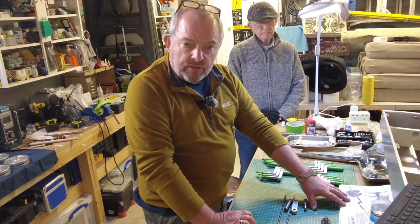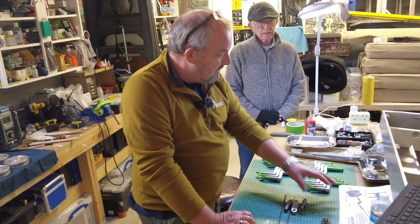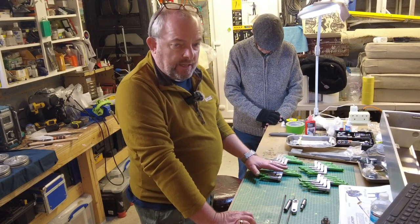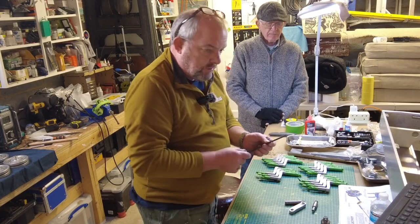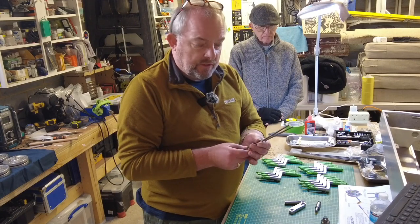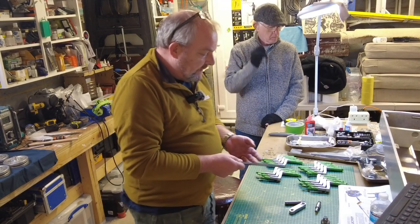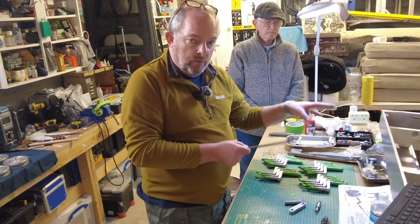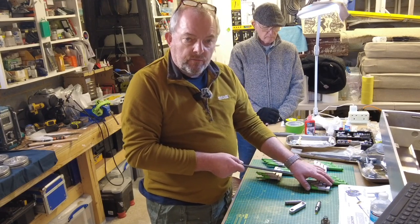So we've put together the axle, the main axle arms and main bars. Reading the instructions extremely carefully, obviously, and following some advice on YouTube. There are four different types of assembly, so you have to be careful. There are two different diameters of rods, a 5.5 and a 5mm, and they position themselves in different locations along the tank. So I've worked out, following the instructions, which assembly parts are which. I've assembled them and clearly labeled them and masked them ready for painting.